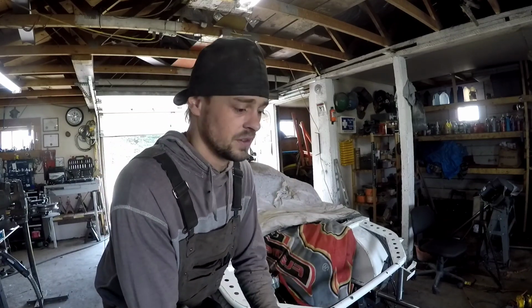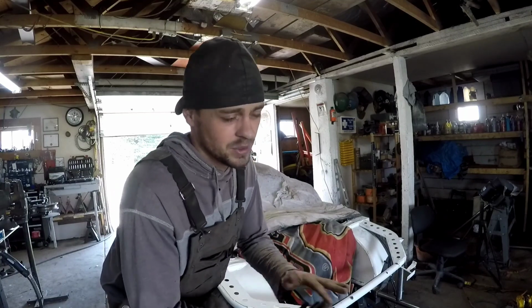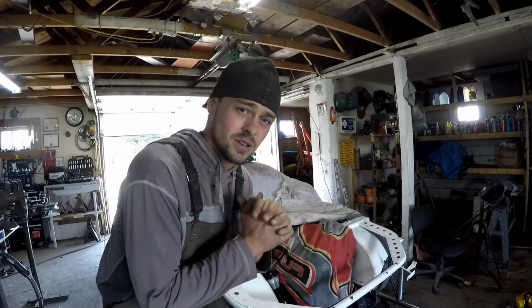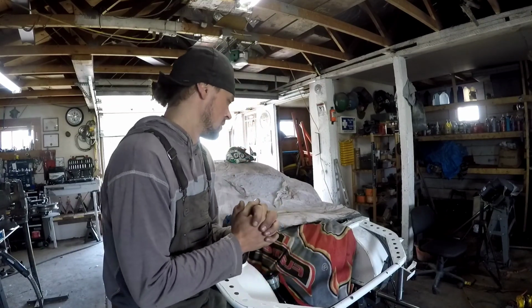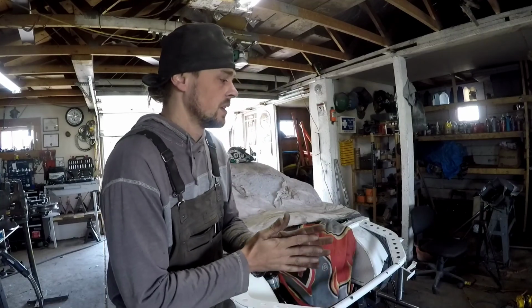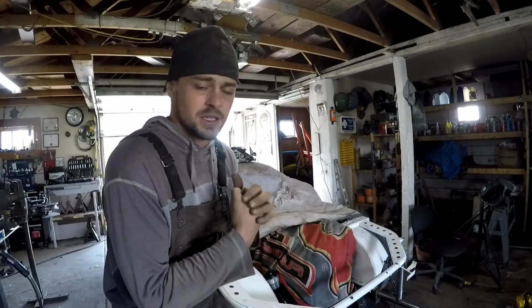When you're not in an accident, it's going to offer the same amount of strength, in my opinion, or close to. It is noticeably heavier and is also way more malleable. So it bent, and when it bent, it kind of took everything with it. DOM's designed to take impact. It's a way harder steel. This is what we use for roll cages.